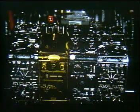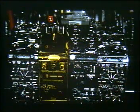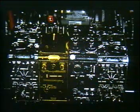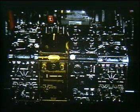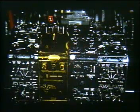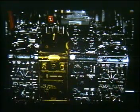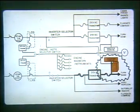115 volt AC power for the PB-10 autopilot is furnished through the first officer's inverter switch, through fuses in the AC fuse panel, to the autopilot equipment located in the radio rack. It should be noted that interruption of power to the first officer's flight instruments could affect the operation of the autopilot. The first officer's inverter warning light, located immediately to the left of his airspeed indicator, will indicate when illuminated that insufficient power is being furnished to the gyro in his turn and bank indicator.